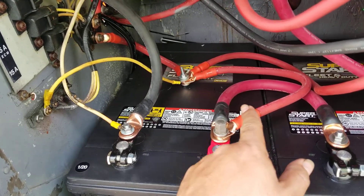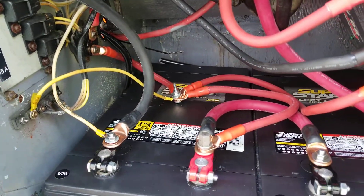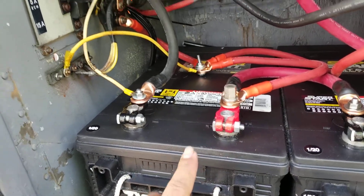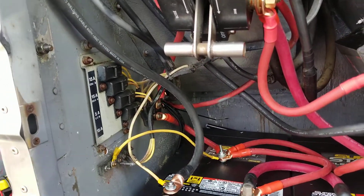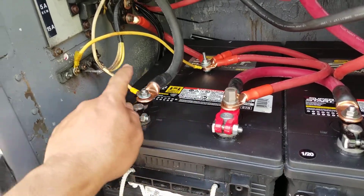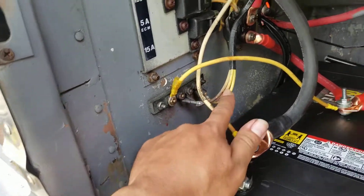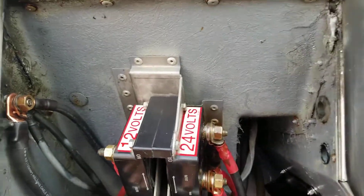I'm missing the junction box — it's not here yet, but as you can see, that's my junction for now. It is recommended that this wire is plugged to 12 volts at all times. That is the only voltage I've discovered that goes into the coach bypassing the main cutoff switch. Somewhere in there, there is 12 volts at all times because this yellow wire, which is supposed to be connected originally to this post, goes in here and spreads the 12 volts on this bus bar. This is ground — the two at the end are ground. All the other four connectors, these yellow wires, are carrying 12 volts and going inside the coach, bypassing the cutoff switch.